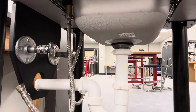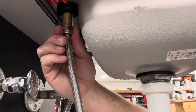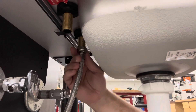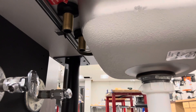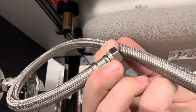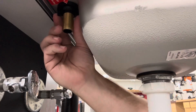Now I have two hoses just hanging from the sink faucet. Underneath the sink there are also two hose ends connected to the valves — we're going to unscrew those too. Now we have our hoses disconnected from the faucet. The reason I'm taking them all the way off is that if you were doing this at home with a new faucet, it's very possible you'll need new hoses with different lengths or sizes, so you'd take them both off now rather than later.